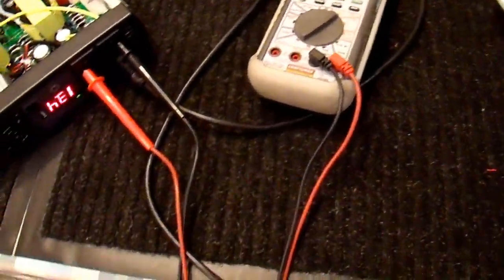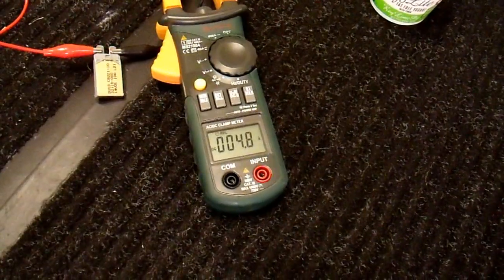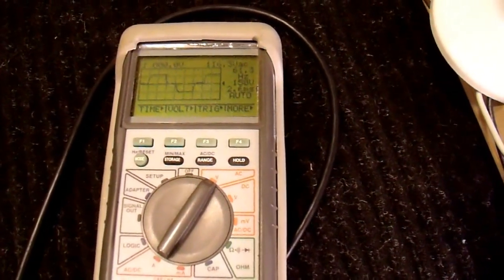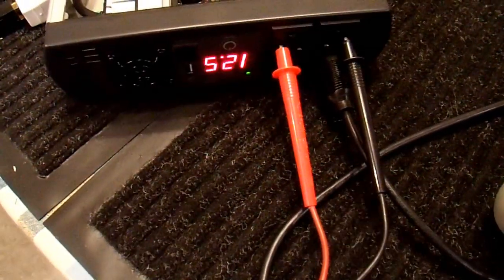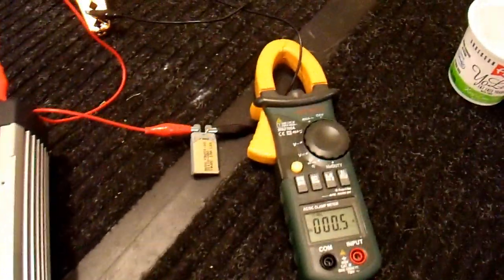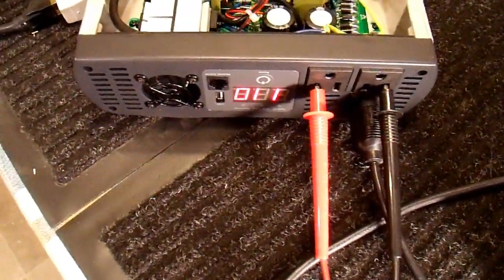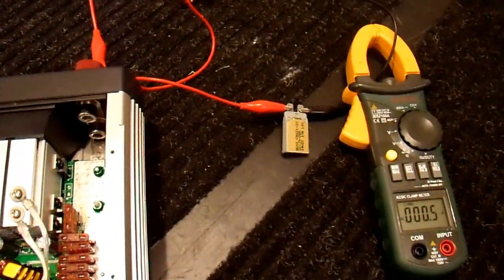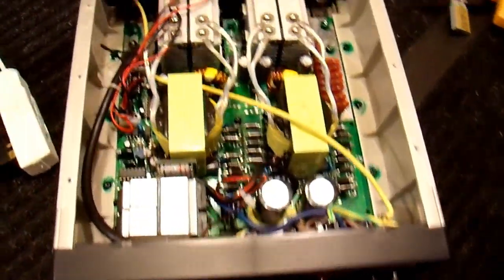Let's see what happens when I turn on this 40 watt light bulb. The light bulb turns on and it draws about 4 or 5 amps — that's what it should do. My waveform still looks good, still around 60 hertz, 116 volts. It still says zero watts. I'm going to try a 100 watt bulb now. This is a 10 amp breaker, so I can't power it for too long through that. But it's still drawing the correct amount of current, and I don't want to overheat my alligator clip, so I'm going to disconnect it. The inverter is, at least, somewhat working.